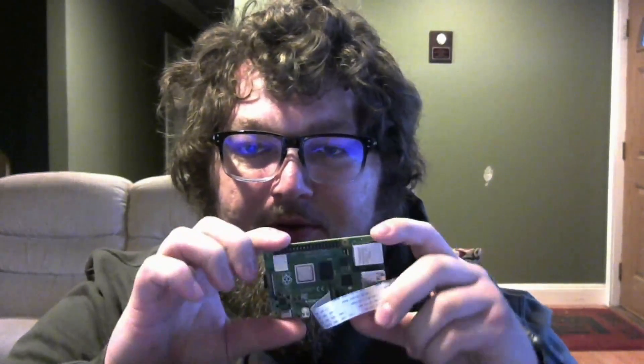For this project you're going to need a bit of hardware. This little maker board is a CSI bridge, which makes it so your Raspberry Pi can use HDMI natively through the ribbon cable. You'll need a Raspberry Pi — I've seen people use Pi 4s, 3s, and Zero 2 Ws, but the Pi 4 probably gets the best response because of its hardware. They have all the documentation on the Pi-KVM site, which we'll go through shortly.